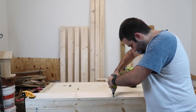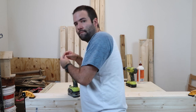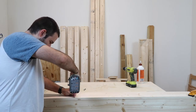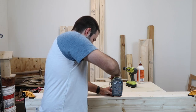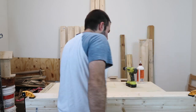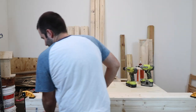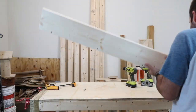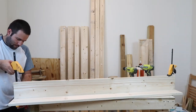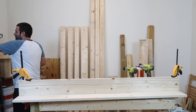Do not just leave this as glue. I do recommend putting a couple of screws, and that way you won't be thinking all the time about what if this is going to break. I did also use some brad nails just to hold it in place — I'm not relying on them at all. It's just to hold it in place while the glue dries and I put my screws through. A quick tip: I do recommend you use a square surface so you can actually lay it flat, because it's just going to help everything stay straight and help it not curve while you're putting all your screws in.